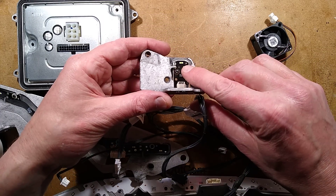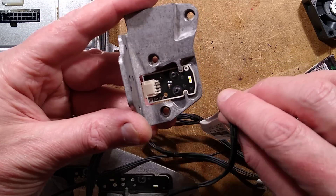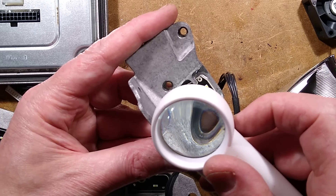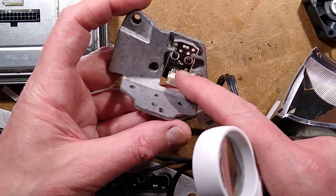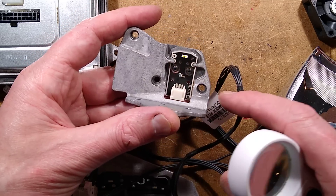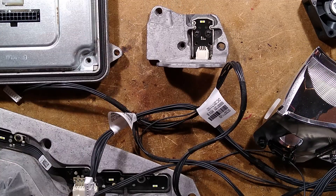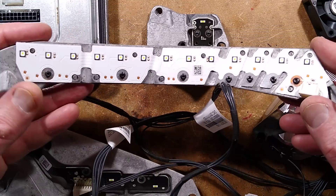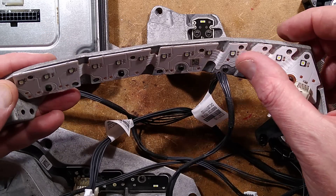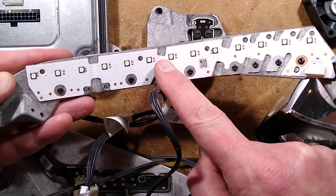All the headlights use very, very tiny LEDs — super tiny indeed. They're just 3-volt single-chip LEDs with a little snubber network — a resistor and capacitor — across each one. Each module effectively has a series of connections: two connections for the LEDs and one connection going to the metalwork via screws through the circuit board for screening purposes. This decorative panel also uses 3-volt LEDs in an unusual style, on separate aluminium sections of a continuous PCB, where the ribbon between them jumps off the aluminium.